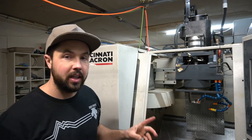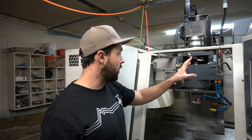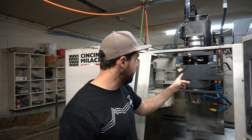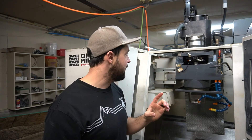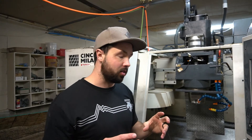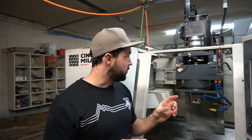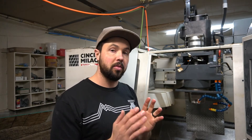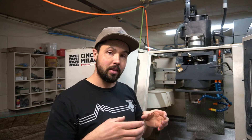I do have just a little bit more to finish on this side of the mill. We did the cabinet a couple days ago, but I need to get this cover on. Before I do that, I'm getting a couple new belts. This belt I have on it is a 30 millimeter belt and it's got some weird harmonics — it's causing vibration in my spindle motor and my spindle. So I'm gonna swap that out for two 12 millimeter belts, which is supposed to cut down on some of the harmonics and the way that the air moves through the belt and the teeth in the belt.